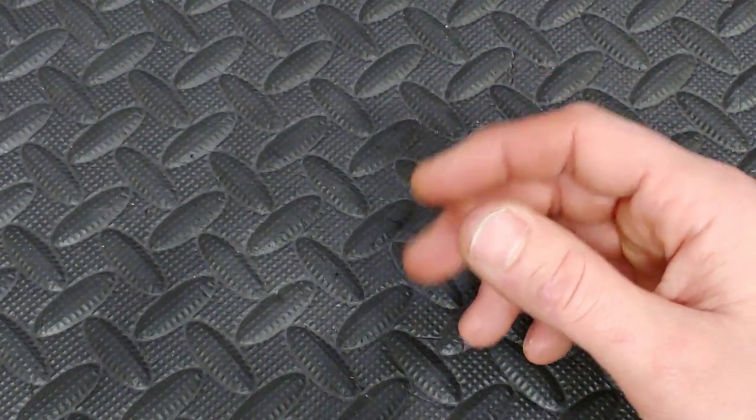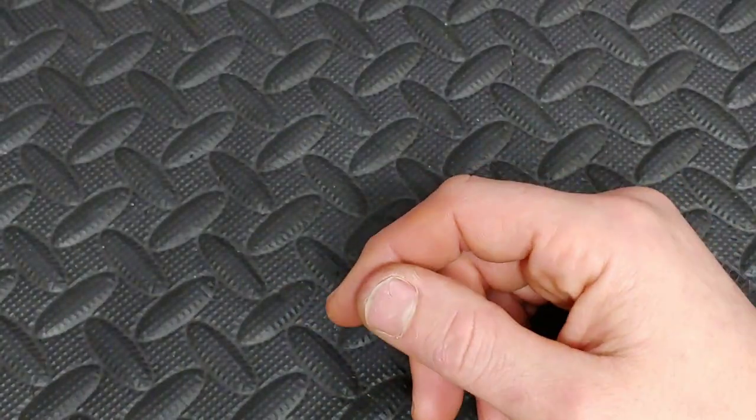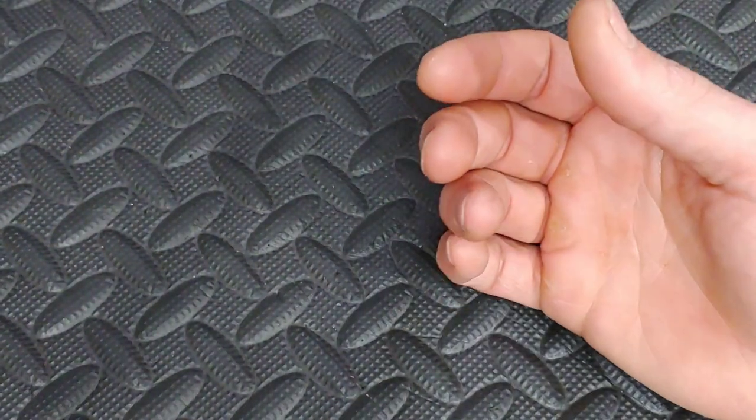And then there's edges that are incredibly sharp and last so long, and there's edges built for longevity. They're built for strength, like convex edges. You can play around with different angles to get different types of performance. And then there's different finishes, right? There's different grit finishes. And using the right stone for the right steel is very important.